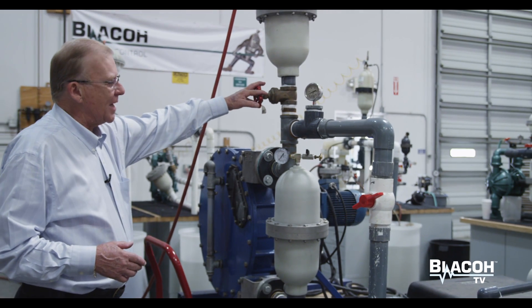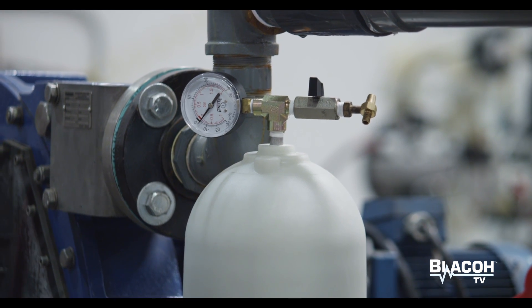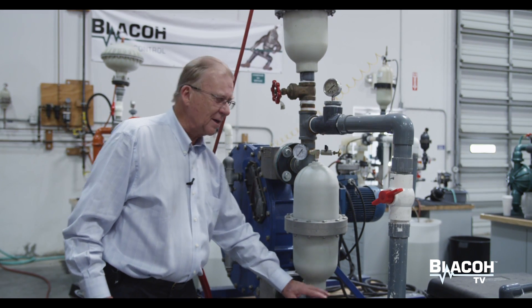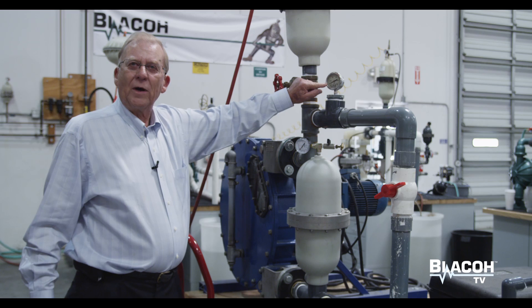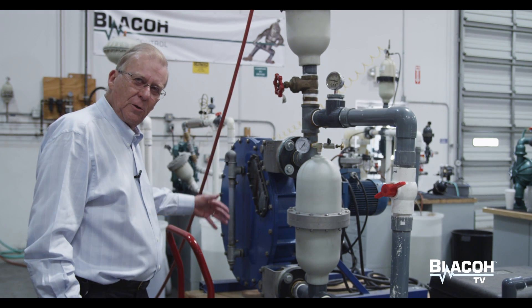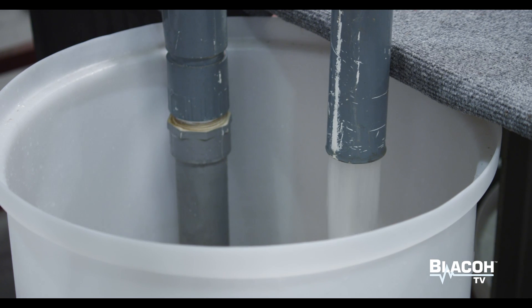The dampener is isolated. We have an inlet stabilizer set up already to function properly so that we don't have any water hammer acceleration head on the inlet side. But you can see the discharge of the fluid from the hose pump is going between zero and 22 psi, as the roller shoe revolves around and squeezes and opens the tube, and the flow is intermittent.